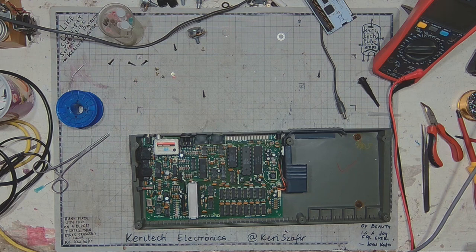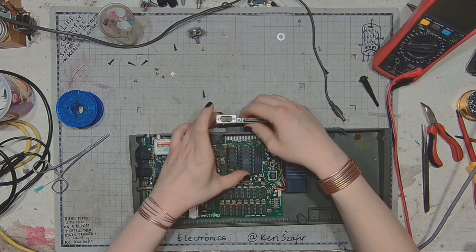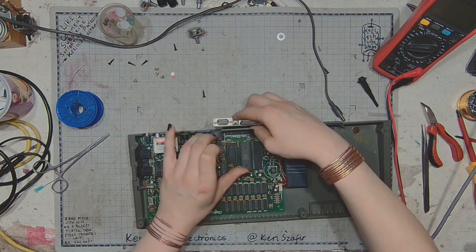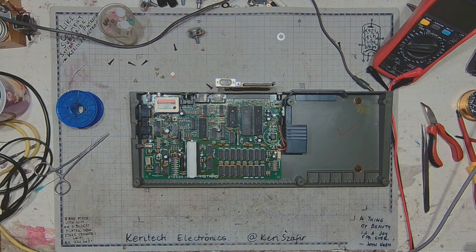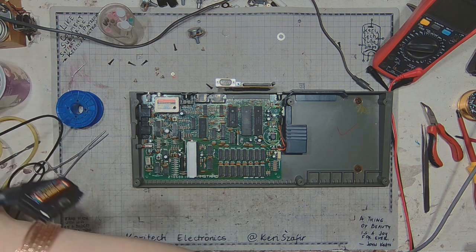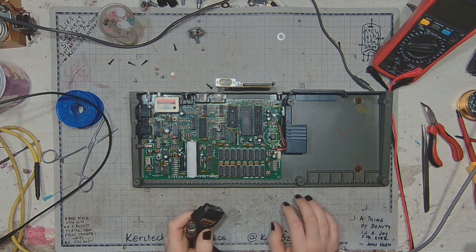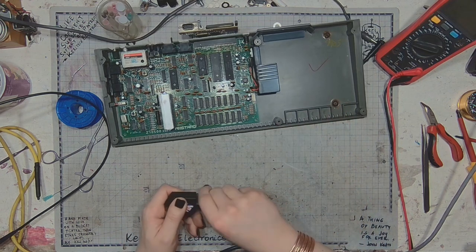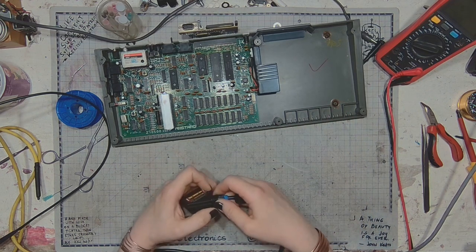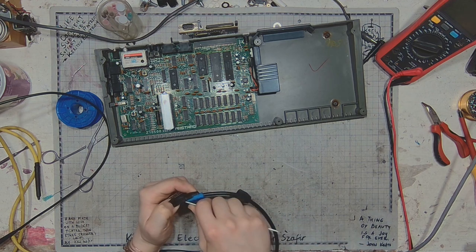Okay, so at the bench again, and I probably know the source of the issue with the buzzing problem. I think it will be tackled after I modify the signal cable, because it looks like after I modded it to Peritel, and even before, the red, green and blue signals that were summed were fed also into the audio line, and one slight mod of the cable should take care of it pretty nicely.